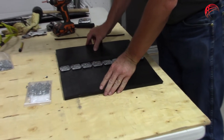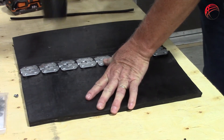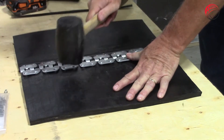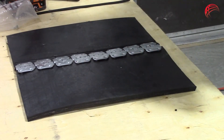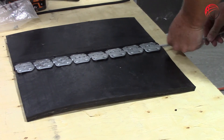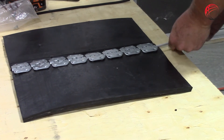Following the same steps, we position the fastener centered on the belt and aligned with the first side of the belt. Again, tamping down the fastener on the belt ensuring the belt is tight against the belt stops on the fastener. Note, it is possible to install the fastener with the cable hinge connecting both sides of the fastener, allowing for a quicker installation.